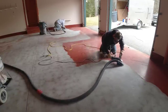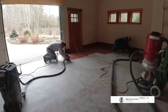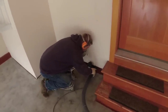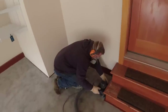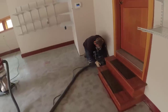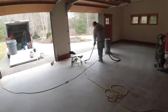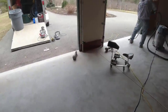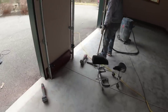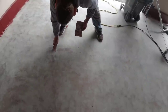What we're doing right here — there was a painted coating on here, I don't know if it was just regular floor paint or some type of epoxy. It was a pretty old coating and it was peeling up in quite a few spots. The homeowner thought it looked ugly, it was all scratched up, so he decided he wanted a brand new coating with flakes in it. We got this thing ground off — it probably took us two to three hours to do it by hand. We have a big floor grinder back in the trailer, 220 volt, but it just didn't seem to get this stuff off very fast. It actually seemed to come off faster doing it by hand.